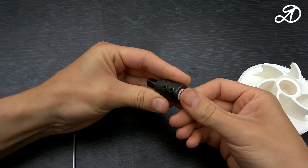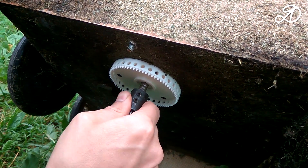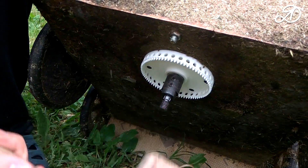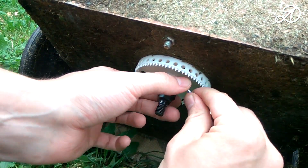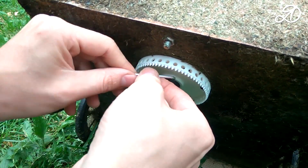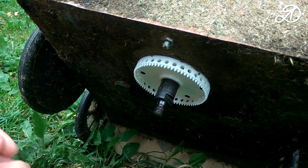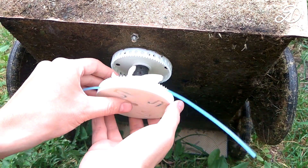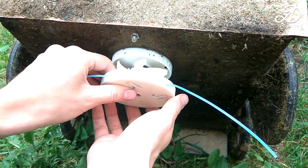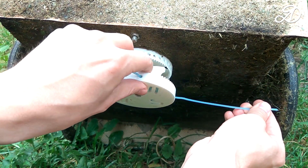An adapter is used because the adapter is larger than the shaft diameter. Then it will be replaced with a metal one. You can't fit the adapter too tightly on the shaft — you need to leave a gap. The length of the trimmer line must be such that it does not reach the wheel.